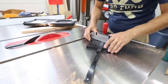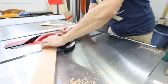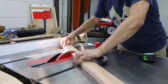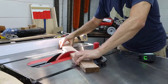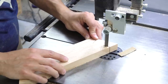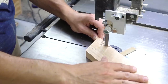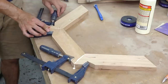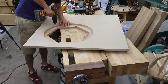With that template ready, I can start working on the edging stock, which we make up of segments. I'm going with a 6-segment ring just to shake things up a bit since the radial veneer is 8 segments. I'll assemble the ring in two halves, so I'll cut some clamping areas into the waste area near the corner and get those assembled. Once the glue sets, the segments can be screwed to the template.